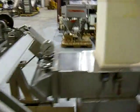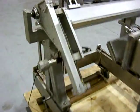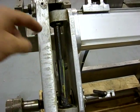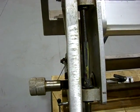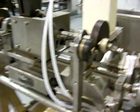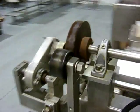As far as any other operation of the machine — lubrication: it's good to put a little lubrication on the shafts. There are a couple of grease zerks here on the cam follower and on the bearings. I recommend doing that once a month and giving it a shot of grease every now and again.